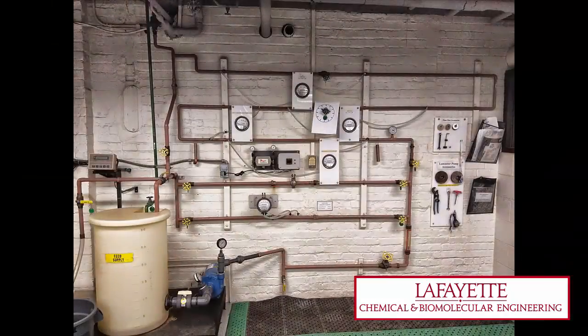To operate through the Venturi meter, start by opening valves V153 and V156. Next, close valves V151, V152, V155, V159, and V160. Set the flow rate to the desired value using valve V150. Measure the pressure drop using the Venturi pressure meter between valves V153 and V156.